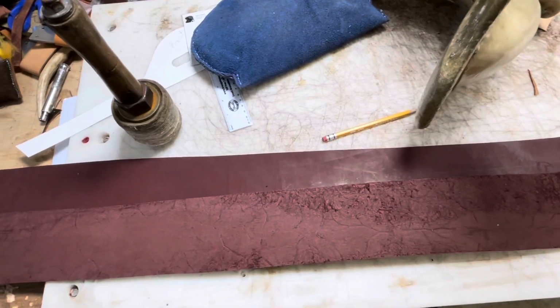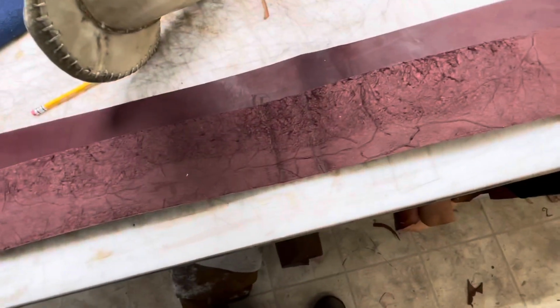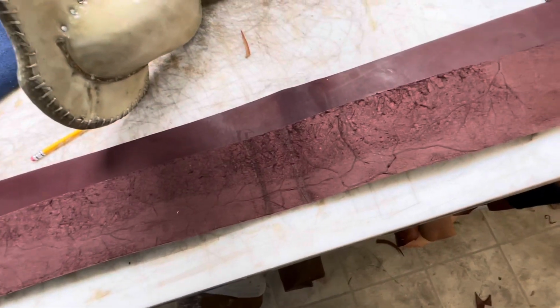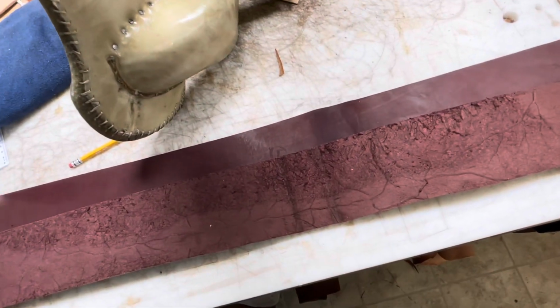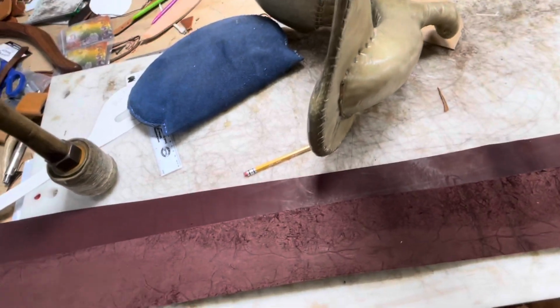So now what I'm going to do is, like I said, I set the cutter at 3 inches. I got these at 3.5. So I'm going to set it to where I cut one side, cut about 1/4 inch off of that, and then flip it over, because then I'll have a good straight edge there, and then I'll have another straight edge.